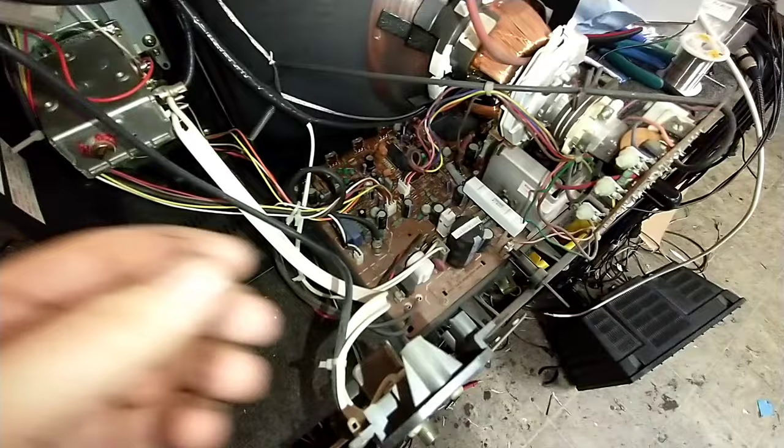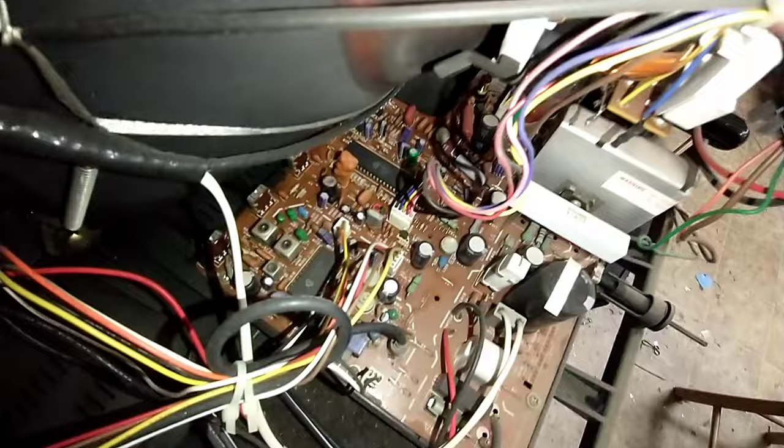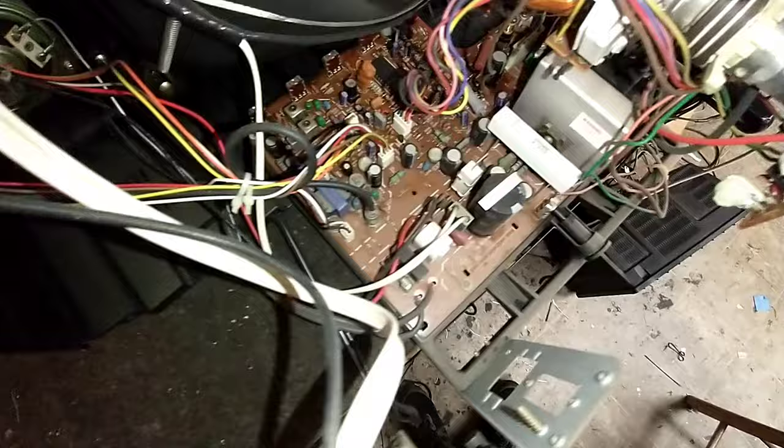So this is much like very many of the 1980s TV sets. And it's just a big jungle IC back there, and that controls all the subsidiary circuits. It's kind of primitive. So where we're looking at, I see back there that there's glue and electrolyte there where that boost cap is. So that's probably bad. Just a good visual inspection sometimes is all you really need.